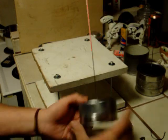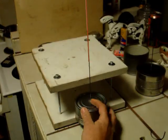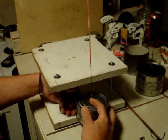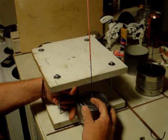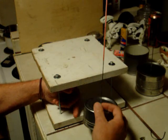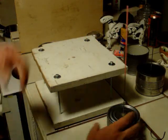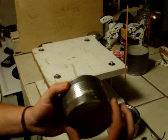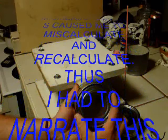This displacer here is two inches, or 5.08 centimeters. With the displacer at 5.08 centimeters and the chamber at 10.4775 centimeters, the displacer would take up about half the distance inside. We don't want that because we'd be working with over two inches worth of air. That's more than half the height of the displacer — not good. More than two inches of air would make the machine very slow.